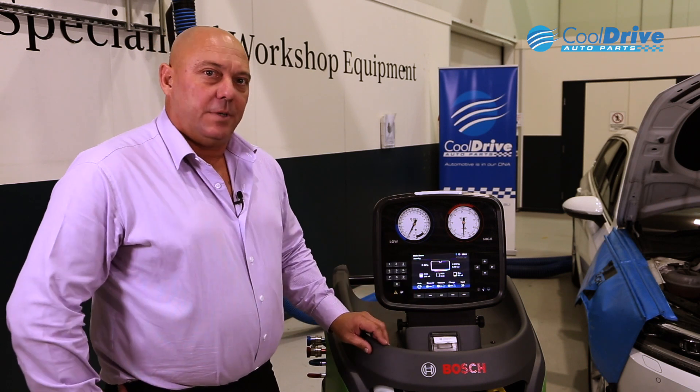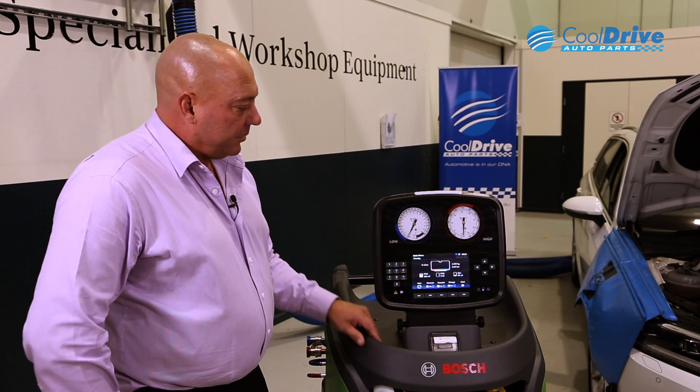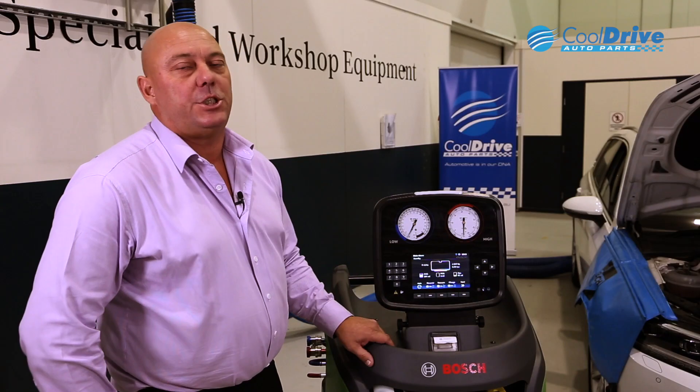In the charging process of the internal cylinder, we actually stash a certain amount of refrigerant inside the manifold and the hoses, hence why we only show approximately 2.6 kilos of refrigerant instead of the initial 4 kilos that we charged.